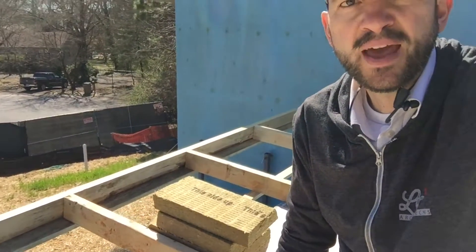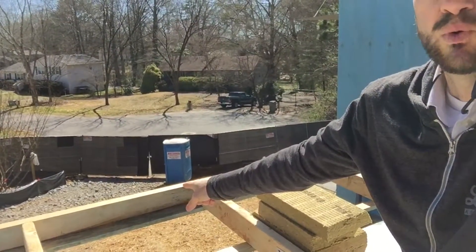This is the front of the house where we have an 18-inch overhang — that's 18 inches past the four inches of rock wool insulation. In these areas we have six-foot-long outriggers. And on the sides and back where we have an eight-inch overhang, we've used a four-foot outrigger. On the outside and interior perimeter of these outriggers, we do have a sort of a rim board.